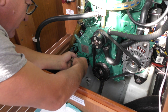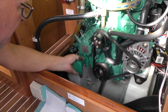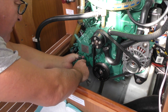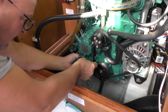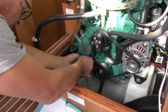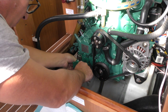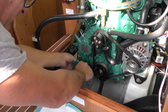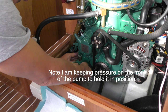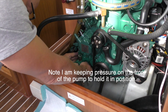Put our pump in there very carefully, just give it a slight turn so that it meshes with the gear. Check that the o-ring is still there — okay. I'll just loosely fit the first bolt and then one diagonally opposite and the bottom one.